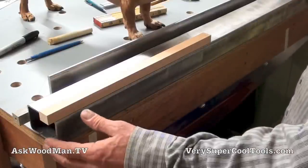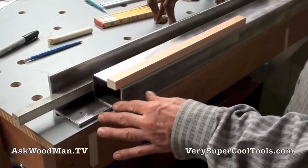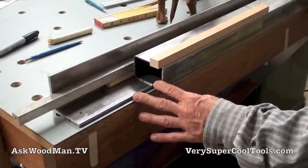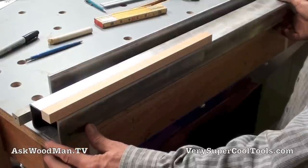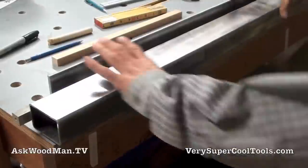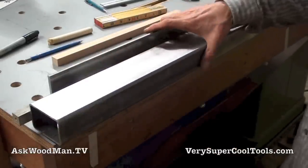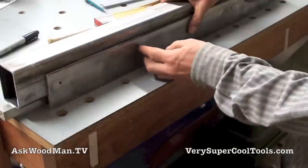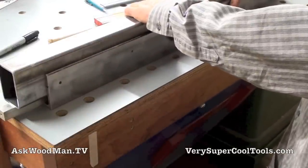If I have to, I can re-drill some holes and shift this off one way or another very easily at a later date, just tapping some new holes in the bottom. But I think I'm going to stick with this for now. What I want to do is clamp these together and use that number seven drill bit to just mark my hole location in the bottom here. I'm not going to try to drill all the way through with the cordless — I'm just going to mark the location, and you'll have a perfect match drill.